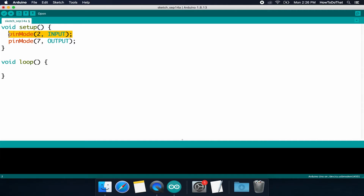You will find online kind of a divide of people: some say you should declare it as an input and some say you shouldn't, and here's why. The moment you turn on the Arduino and it boots itself up and it's now ready to execute whatever program you've given, it defines automatically all the pins as inputs, which means we could actually delete that line and the program would still work just the same. We could still use pin 2 later to read in the value, but it's already set as an input automatically.